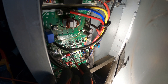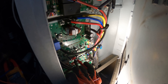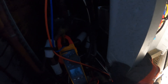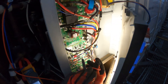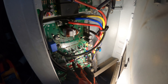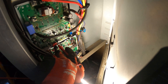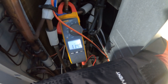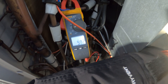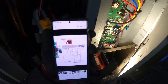Now let's check between the 15-volt terminal and ground. I changed my leads to the bigger ones — easier to make contact. That's not looking good. You can see it's going down. We don't even have 1 kilo-ohm. According to this, we've got a bad board. But let's do a complete check.